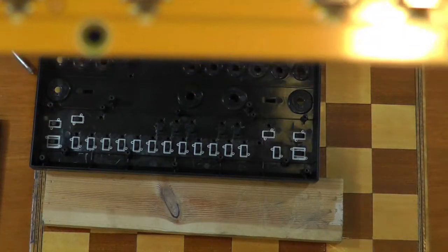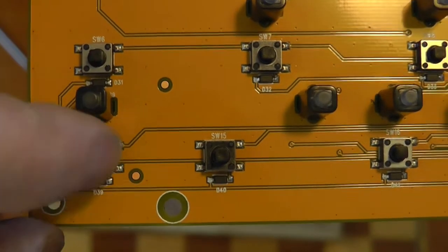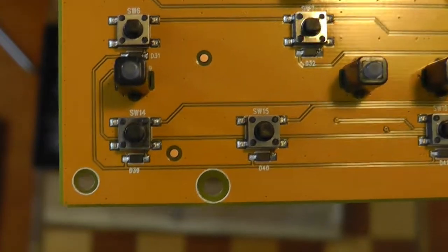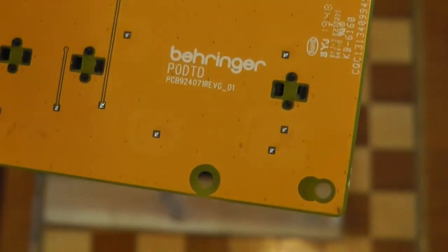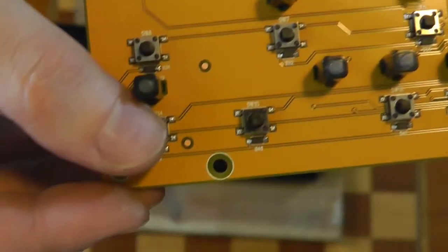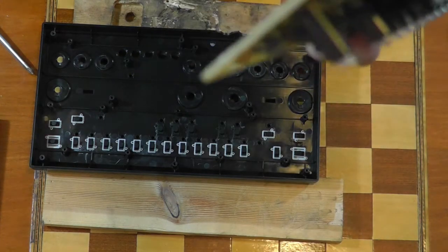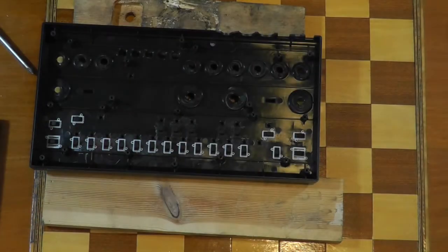Yeah, okay. So there's one. See the four solder pads? That's solder pads, not shoulder pads. This is the 80s. Solder pads. Flip the thing over, and the solder pads aren't on the other side. So these are surface mount tact switches. Yeah, that will be a sod to do, but you can maybe do it with a fine enough tipped soldering iron. But yeah. Bummer.